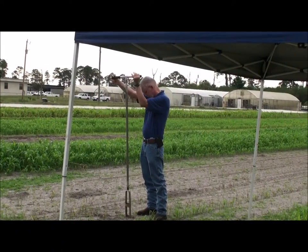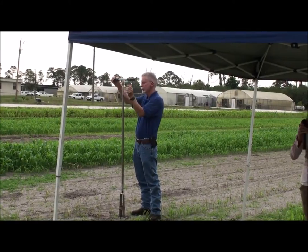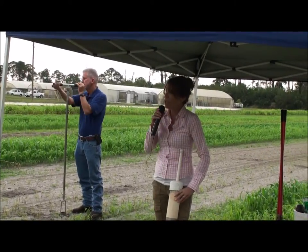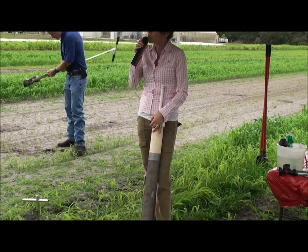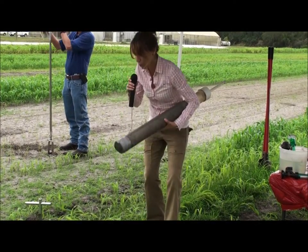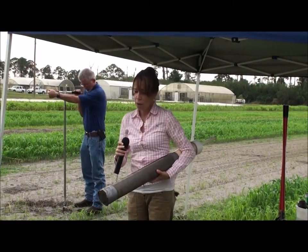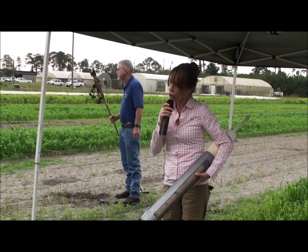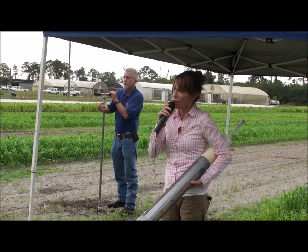We have two types of wells right here. It's a PVC pipe, and the handouts have very good information in terms of diameters and everything. You want to have a screen — you screen it out and make holes or cut transversal cuts all around so the water can come in, but the screen will avoid all the soil particles from coming in.